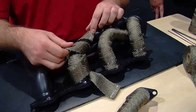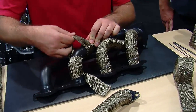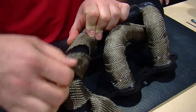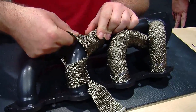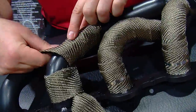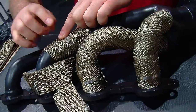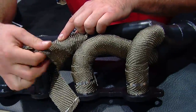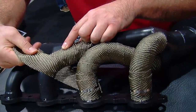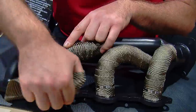Once you get going, anchor it. The first revolution is going to be nearly a full overlap, then go right on to a quarter-inch overlap. Each revolution, aim for that quarter-inch so you let enough heat pass through the material so it's not going to affect the metal. Every revolution, also put an anchor down there so it doesn't come loose on you. Pull tight and get a snug fit — you don't have to pull terribly tight, but a tight fit is a better fit.